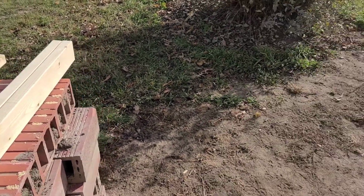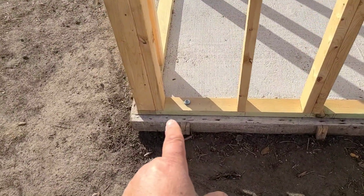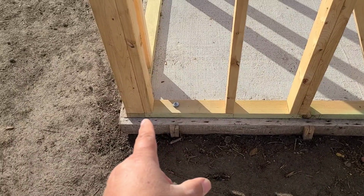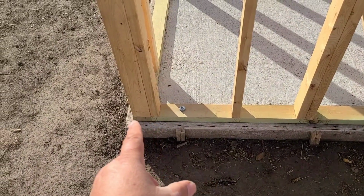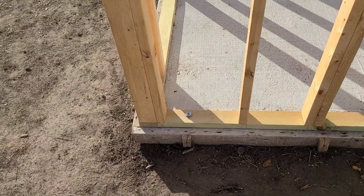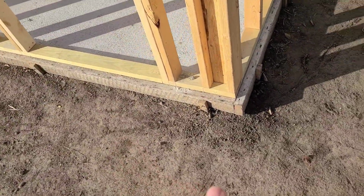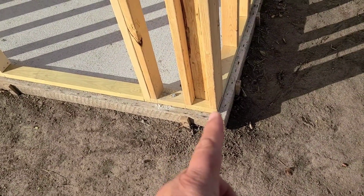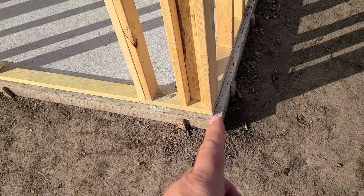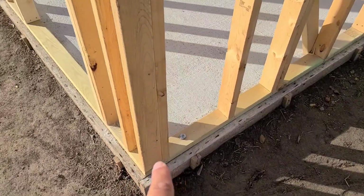If you're doing a wall, you'll have 2 types of wall. You'll have your inside measurement wall, like this end wall here stops right here. And then you have your side wall that continues on 3.5 inches beyond that. So if you're doing your long section of your wall, or however it's laid out, that wall goes all the way to the end. So keep in mind that there's 2 different ones.